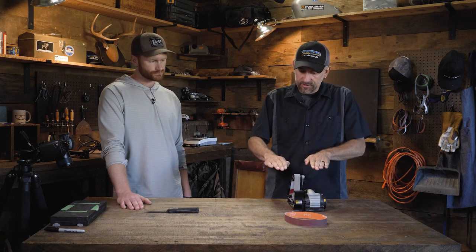It just takes a moment to assess the knife you're sharpening and understand how to apply what you've learned about angles, steels, grit progressions, and levels of damage. The biggest thing I'm doing here is using muscle memory from sharpening so many Infidels, so I have a feel for that angle when the machine is at 20. But the effective edge angle on the spear point is closer to 30. For someone starting that journey, I'd recommend starting at 30 so you can be in a flatter orientation. You can check the angle of the bevel by coloring it with a Sharpie and testing it on a ceramic or light abrasive like a 12,000 belt. Sharpening or restoring a tip on a knife like this can be a real challenge, but go slow and light pressure, and it's something you can do in your own shop.